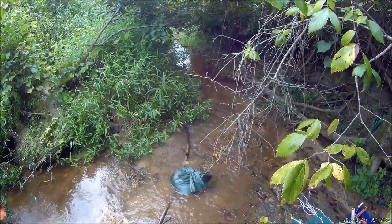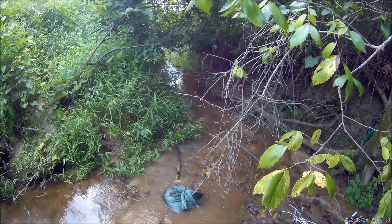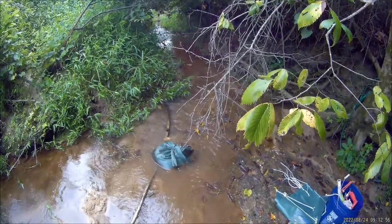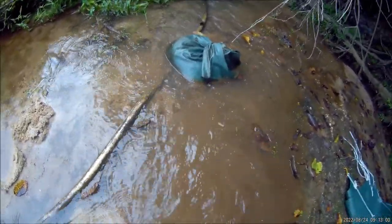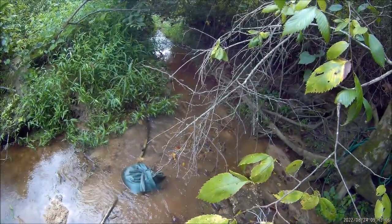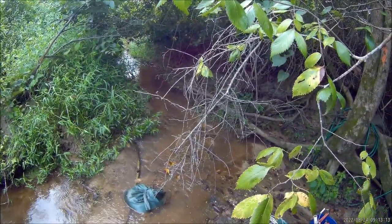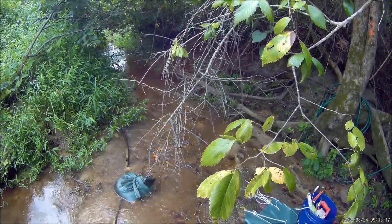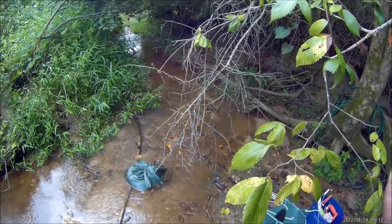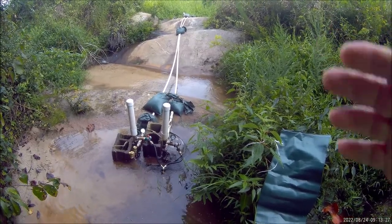When I first decided to install a ram pump in this creek, I thought I'd just get some rebar and drive it in, but you cannot go more than four inches deep anywhere here — you're on bedrock. I cannot find a single spot from here downstream a thousand feet or more to drive a rebar into the ground. So these sandbags have saved the day, and they're really good for keeping your drive pipe as secure as possible to get more performance out of it.